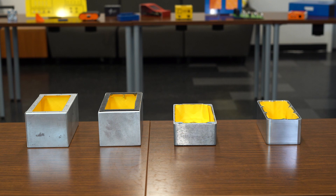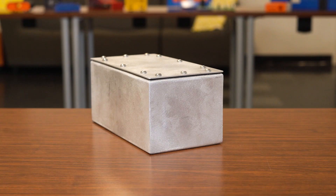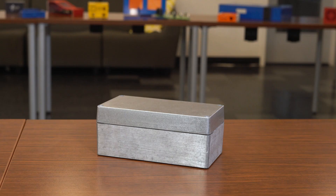For this experiment we will be testing the following manufactured enclosures. The first is a 5-sided sheet metal enclosure made with 5052 aluminum with no finish. The second is also a 5-sided sheet metal enclosure made with 5052 aluminum with a heavier gauge cover and no finish, but with fully seam welded corners, a neoprene rubber gasket for the cover, and sealing screws.